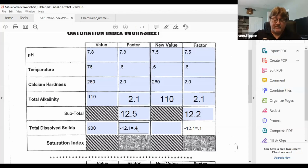If my actual pH would have been below the line, it would have told me that we were corrosive, that the water was chewing away at the pumps and the shells and the motor. You know, if we do a new pool startup and in 6 or 7 months, all of a sudden you get these big pock marks on the side where it's etching and peeling and falling apart, it's simply because somebody didn't give the water calcium. And water is naturally aggressive, and what it seeks to balance itself is calcium. And either you give the water calcium, or it says, okay, don't worry about giving it to me, I'll take it. And it takes it from the shell. And that's why your pool starts to deteriorate or fall apart.